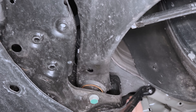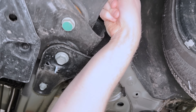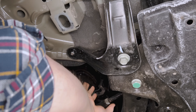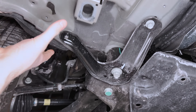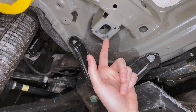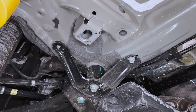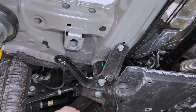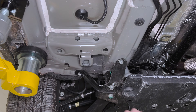Essentially, as soon as you get to this threshold, it all changes. On EVs, this structure comes down the rail underneath the floorboard and then kicks immediately out to the rocker panel — there's essentially no torque box structure. There are similar decking interfaces here with the body, but all the structure you're seeing here is gone on the EV.